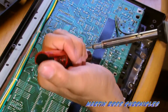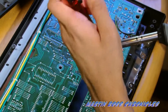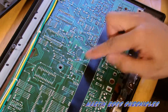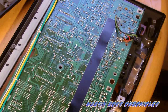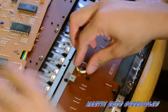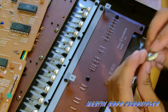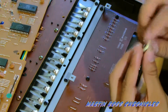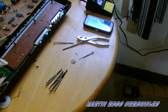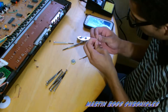Let's do it again. I think you guys just heard it — the pin just dropped, but I want to suck up all the solder to get a nice clean result. And here is your battery. Please make sure that you get the polarity right — this right here will be negative, this is positive. I popped it off with some pliers, just dug in the edge there and popped it off.